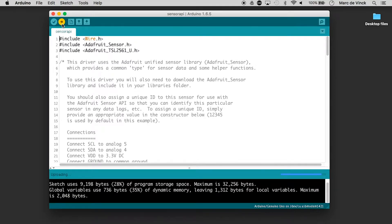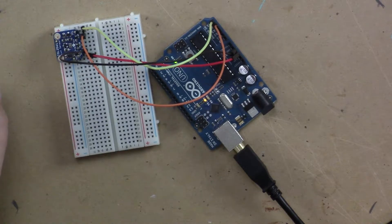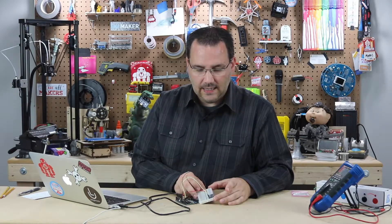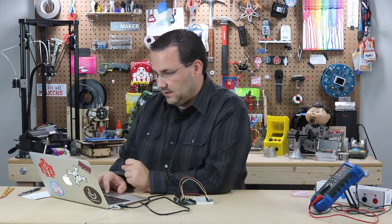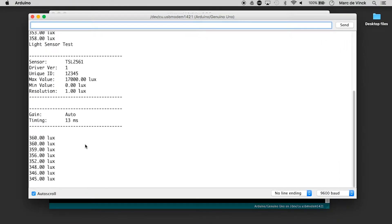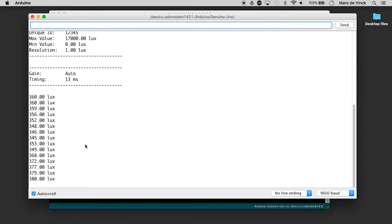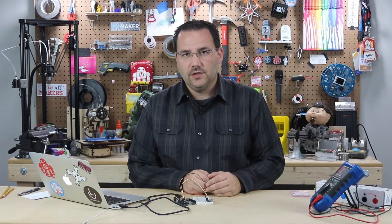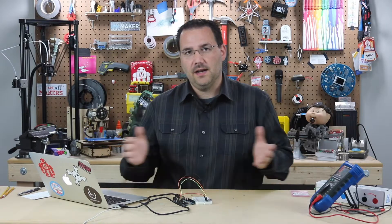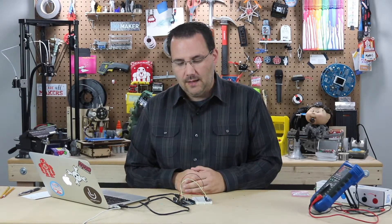Upload. If you look right here, the communication lights go out and we know we're done. It seems a little uneventful, but there's no light indicator here — we have to look at the serial communications. So let's open up the serial monitor. And there we go — we have auto gain and a timing readout. There's a timing function: it controls how often you sample, but also how long you take a sample for. Think of it as averaging to get a more accurate reading of the current lux.